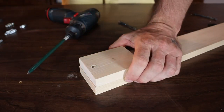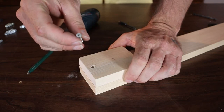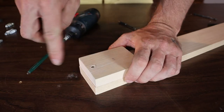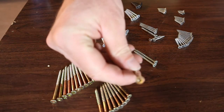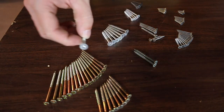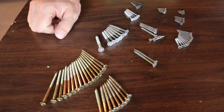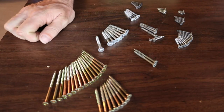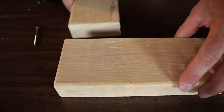Make sure you get yourself a really good bit. If a screw head starts to strip, remove that screw right away and use a new one — otherwise it will strip to the point where you can't turn it anymore and you'll be stuck with a screw in your wood. In Canada you'll see a lot of Robertson screws. In the States you'll see a lot of Phillips and Torx. You don't really want to go with Phillips — they tend to strip out a lot.